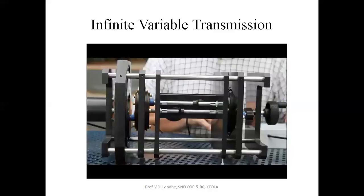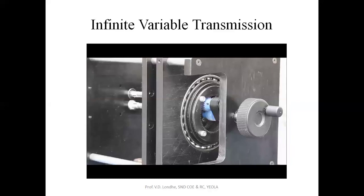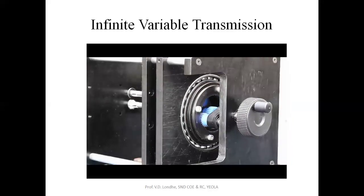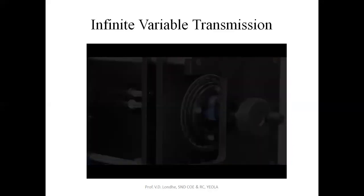That revolving ring gear drives the top shaft, which goes through to the output side and drives another revolving ring gear on the output side. And the output crank is driven by a planet gear whose rotation around the center axis is determined by the relative speeds of the two shafts. Duh! Let's hear Steve talking us through the change of ratios again.